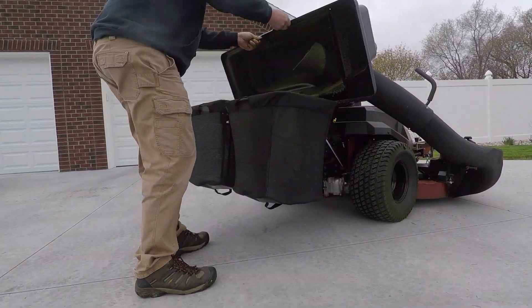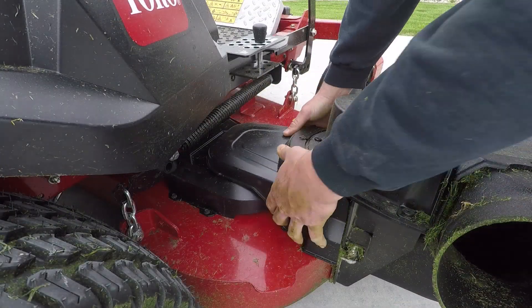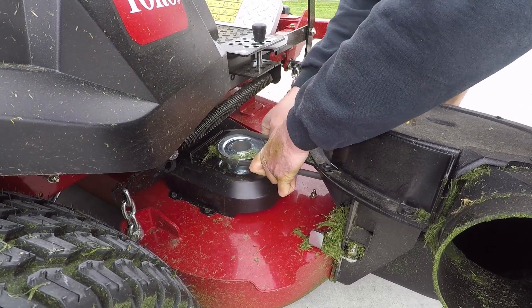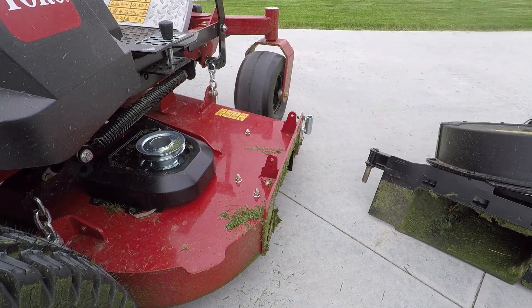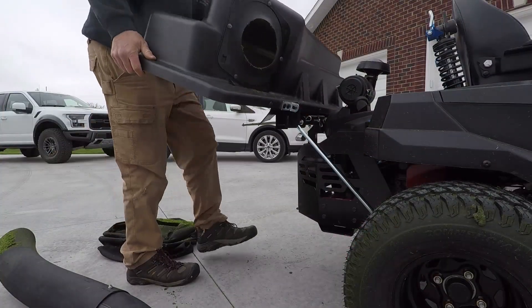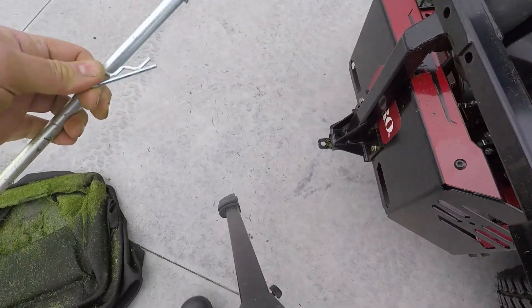Removing the bagger is very simple and there are multiple ways you can go about it. Start by removing the chute and getting that out of the way. From there you have the choice to remove the power unit — just slide the belt off its drive wheel, push a little lever to release the power unit from the deck, and slide it out. Then pick it up and take it right off. The back has a pin that holds in the top cover and you're pretty much done. To put it back together is the same in reverse, and I estimate I could have this unit back on and ready to bag in about five minutes.